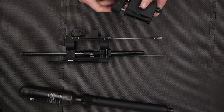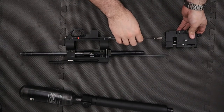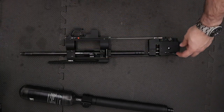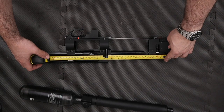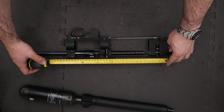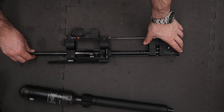The back section of the cocking arm is secured with these countersunk screws, getting those secured with a 2.5mm Allen key, and then we install the middle screw using a T20 Torx bit. We'll leave off the cover plate for this side for now as we'll need to access these screws at a later date. With that done we can start bringing back the sub-assemblies. First we take our back block, install the two grub screws and then back them out so we have easy access to the slot in the middle. Next we put the block in, hook the cocking linkage into that piece, bring back our tape and measure from the front edge to the back edge of our cocking shuttle — on my rifle that turned out to be about 26.3 centimetres.